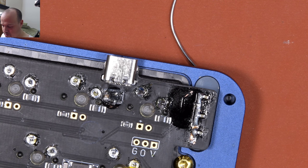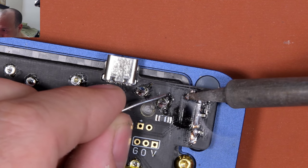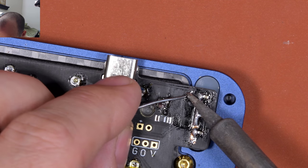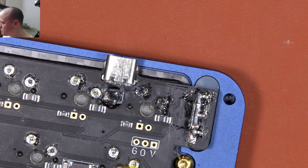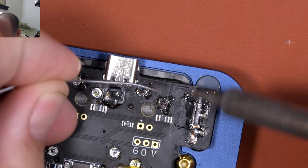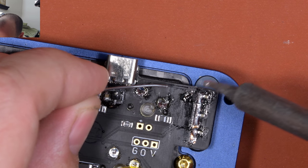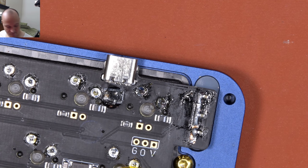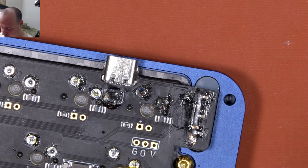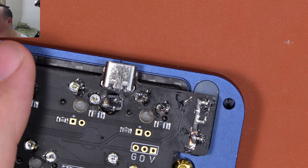Now the silkscreen of the PCB is covering the rest of this trace, so I'll carefully scrape that off so I can add a bit of solder to the other side of the trace after the break — the part that's after the break. Okay, so I've got exposed trace on both sides of the break. Now let me tin that exposed end of the trace so I can stick the resistor to it. That's probably pretty much ready to receive the SMD resistor.